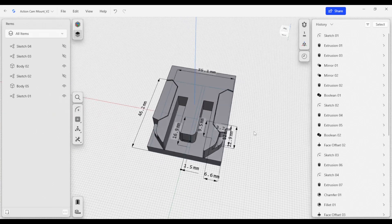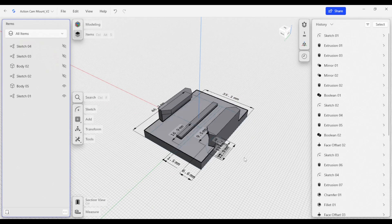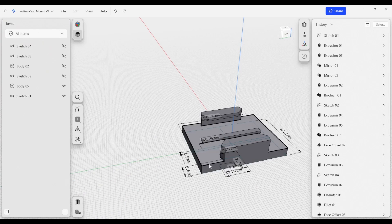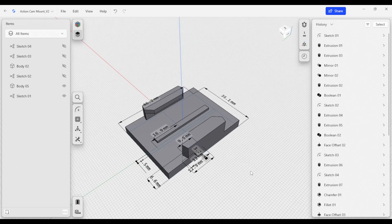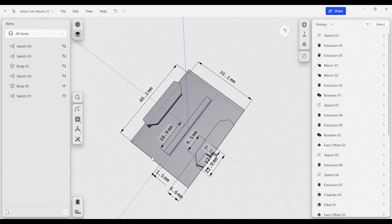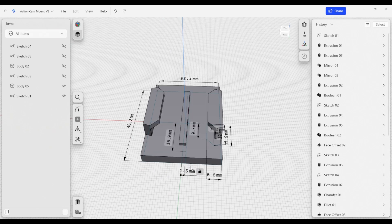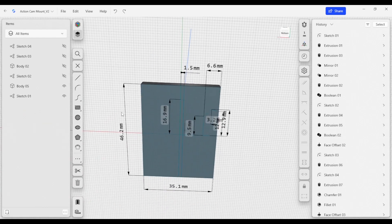With those adjustments we're ready to add a few new features. The first thing I wanted to do was work on the base plate. Considering that this gets printed vertically and the layer lines cut across the part along this direction, I would like to add a bezel that gets printed in a flat manner to help support this part when it gets mounted. If I was to put a hole through this face and push a screw through it, there's a strong chance that we'd get some cracking along the layer lines. So we're going to add a little feature here to help support all of that, and we're going to do that by starting a new sketch — selecting our bottom surface.